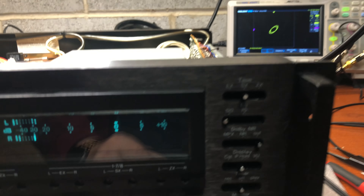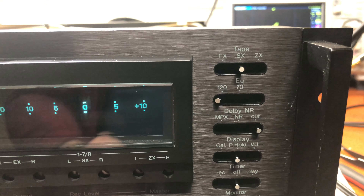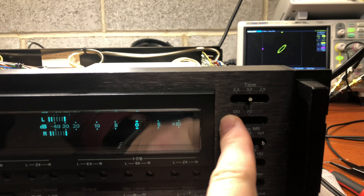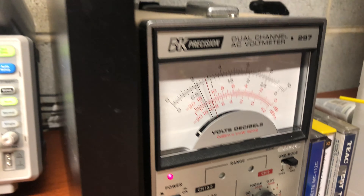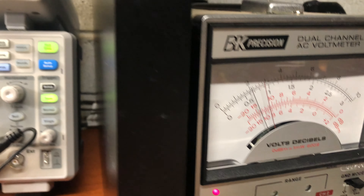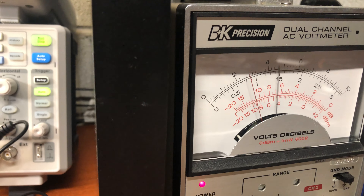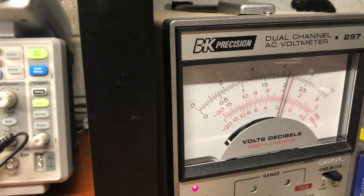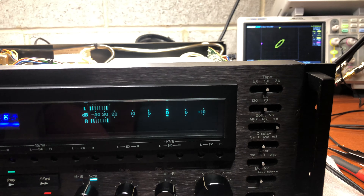The condition we need is the 120 microsecond equalizer. If we use the standard 70 microsecond equalizer, the levels would not be the same — which is crazy. But as I learned, it goes almost flat to 19 kilohertz. Here is 19 kilohertz — levels look great, and it's 70 microseconds. Really great job.